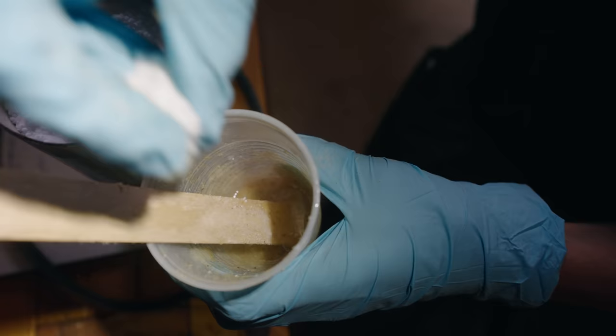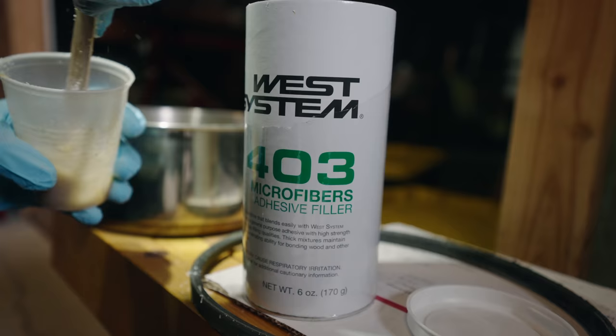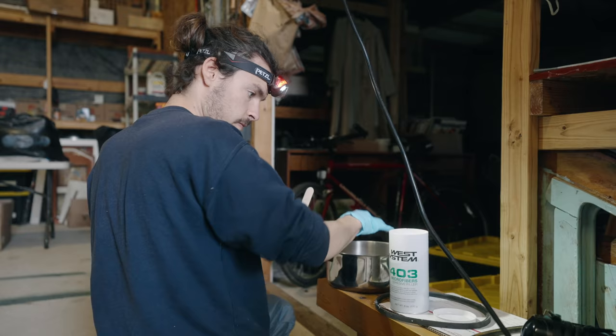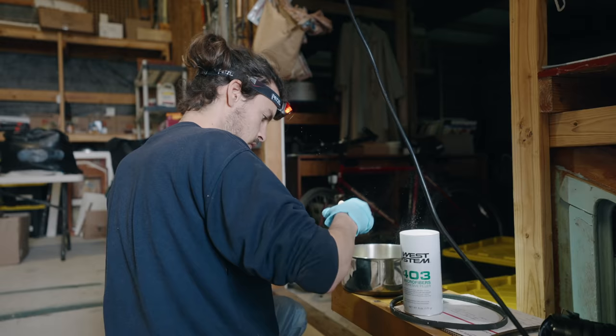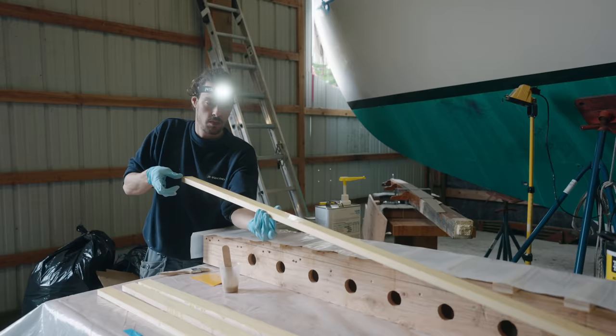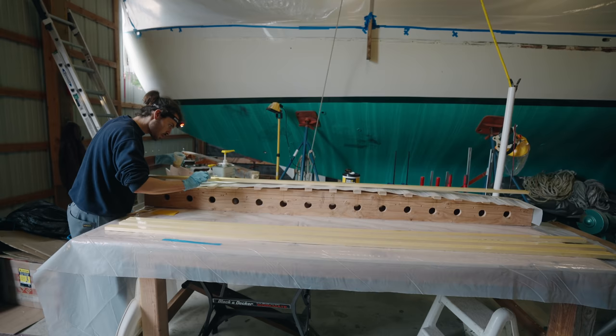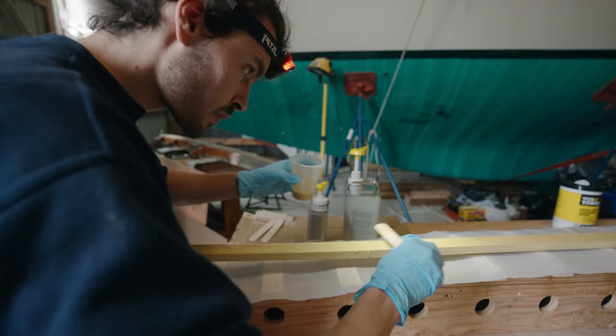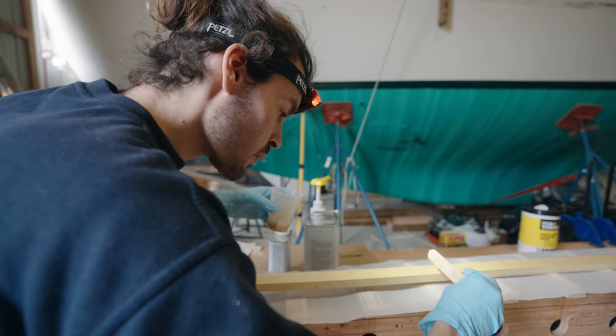Not only will our beams be sandwiched together with epoxy, but before installation, we will also coat the exterior of the beams with finishing epoxy, combined with rebuilding the decks and bulwarks in such a way as to prevent any chance for water to intrude at all. We do think that our boat will hold up quite well in the test of time. Of course, nothing lasts forever, and everything requires a certain degree of maintenance and inspection. But there are steps to take to achieve greater longevity, and we're trying to take all of those steps now.